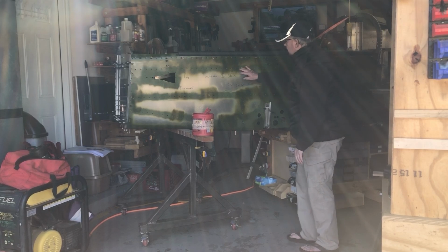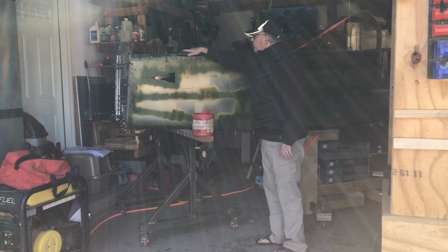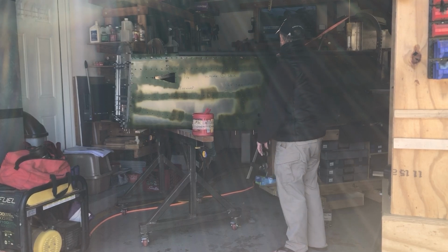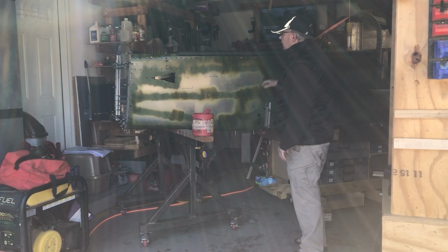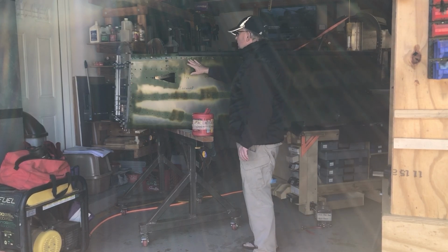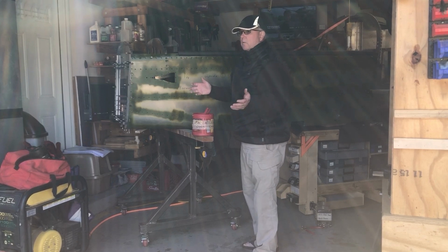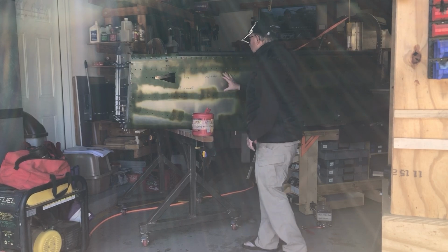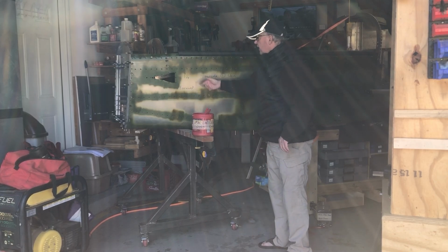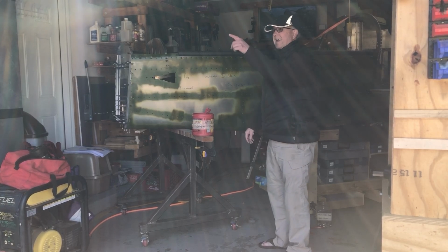Now, we took out every one of the inside braces except for the top one. The top one stays on, and it's clecoed all across, which is that long one with the bend in it. So it's here, and it stayed on, and it gets put in with that piece already on it. Otherwise, the skin would be all over the place. Maybe a little easier to do it that way. I don't know, but we just do it with that one brace in there. So now we have to go back and add all these other ones back in also. But I got to climb up inside there to hold these things, or get somebody who can reach over.